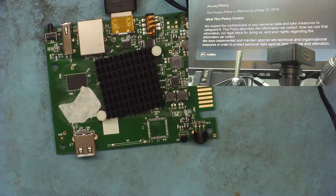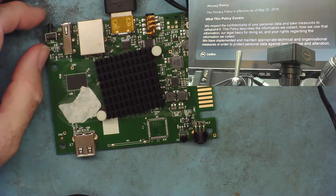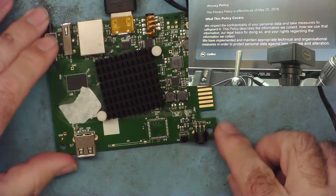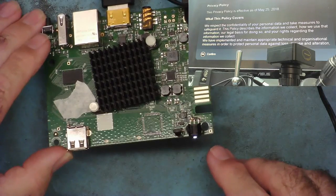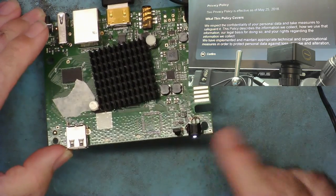I did get a picture initially and it wouldn't boot up. It was stuck in a loop. So I tried it back on the original power supply and it didn't help. So basically on these, you hold this button in and power it up. After some seconds, this reset button will start to flash slowly. If you keep it held in for another 5 seconds, it starts to flash rapidly. Wait till about 10 flashes and let go.